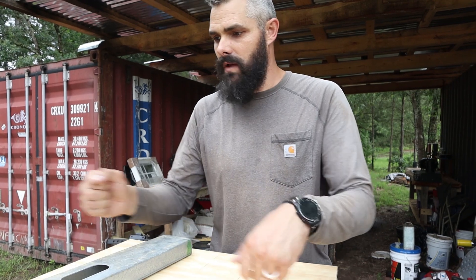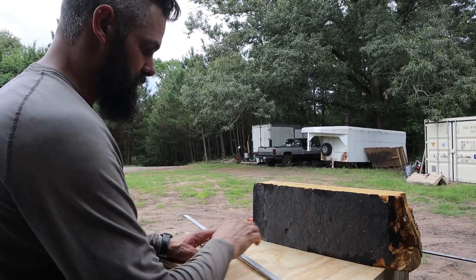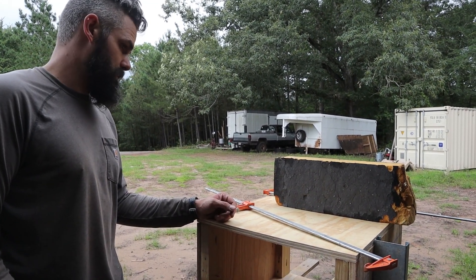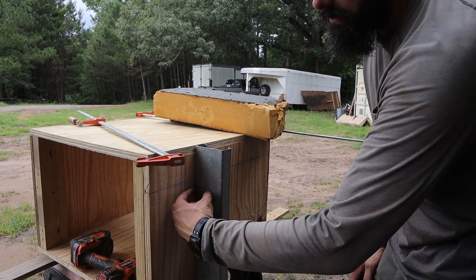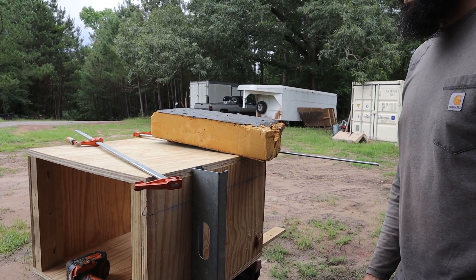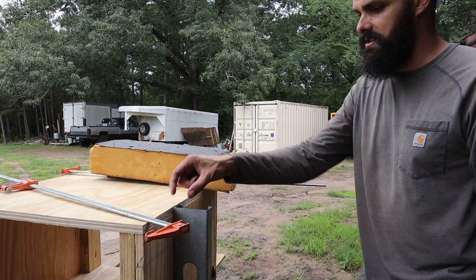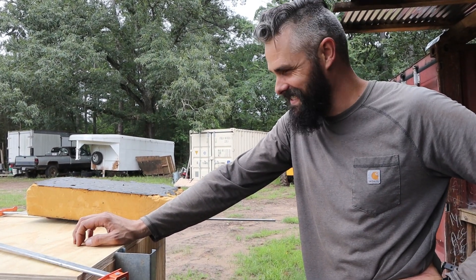Good morning, we are back at this form and hopefully going to knock it out and finish it up today. We're screwing in the side pieces first because the top one is the one that overhangs and has all the weight on it, so we want as much of the weight on the steel as possible. Essentially we're going to build out the steel frame first and then cut wood pieces to go in and space it out an inch and a half. It'll be two pieces of plywood spaced an inch and a half, which will give us the lip for the window — that's where the window flange attaches and screws in. The other part will be covered because this is a reverse frame.